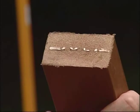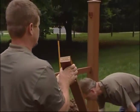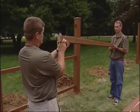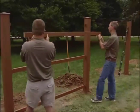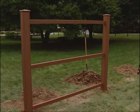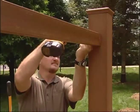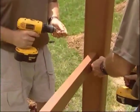FenceScape steel-reinforced rail helps prevent creep or sag experienced with temperature changes or long-term load. Support rails are designed for a maximum span of 8 feet center-to-center of the posts. Like wood rails, FenceScape support rails may have a slight crown. Be sure to install the rails crown up. Fences 5 feet to 8 feet high require three support rails. Fences 4 feet high or less require two rails. If using FenceScape post covers along with a 4-inch by 4-inch wood post, use two No. 8 2-1/2-inch weather-resistant stainless steel or composite deck screws at each rail-to-post attachment.